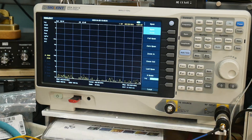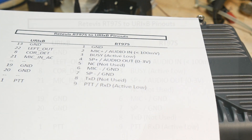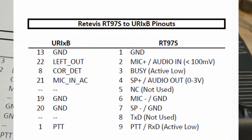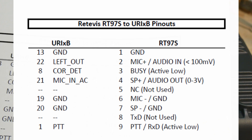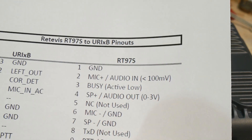I did monitor the busy signal. It's like a 3.3-volt high, and then it drops to ground when it's busy. When you release it, you can see the one-second delay before it comes back on. We saw that setting in the software — how long the device stays on before it kicks off — and that was set to one second, so I could see that on the busy signal output.